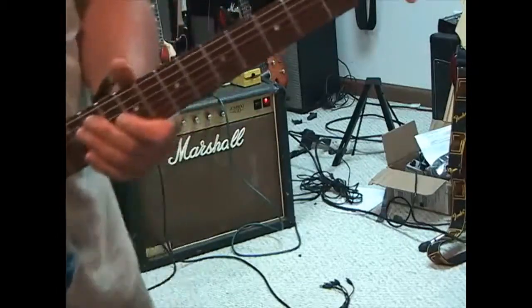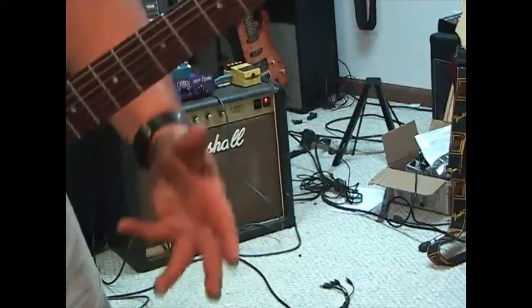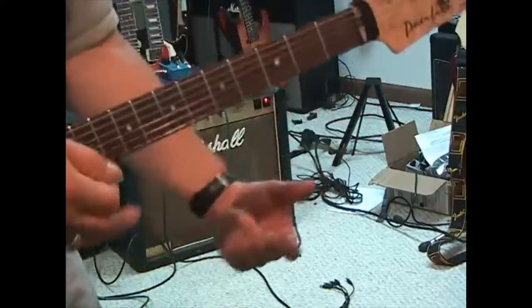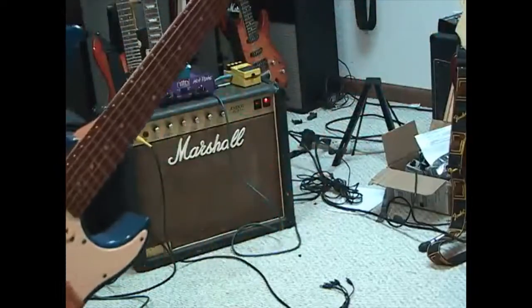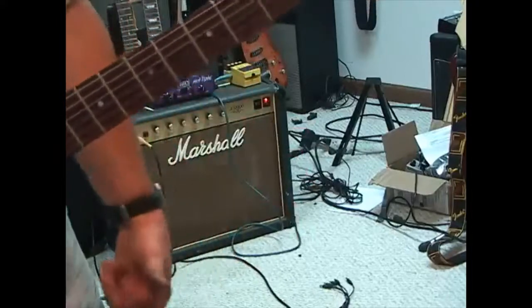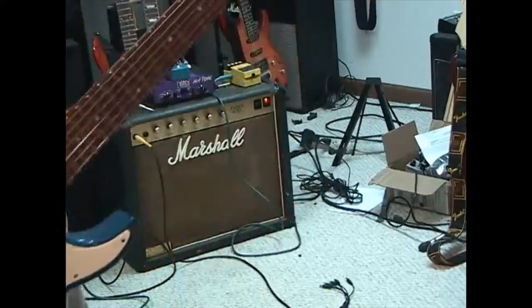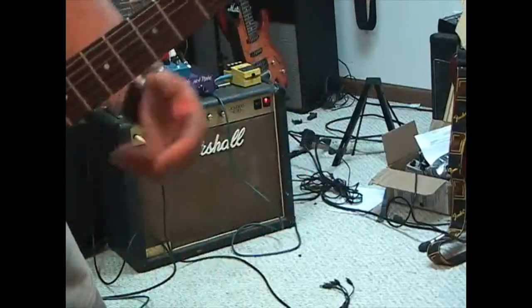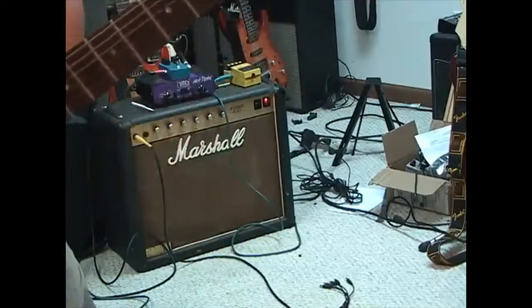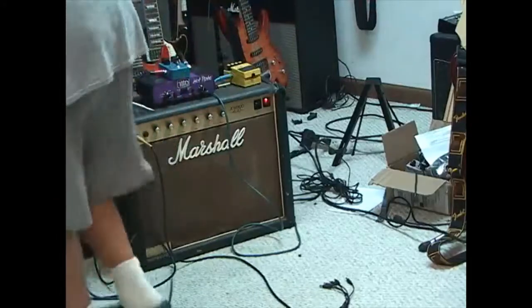One of the cool things they do, like what Eddie did, since these amps do not have an effects loop, is run out of the back. I've got a hot plate, which you can take the signal from the main speaker out, either run a dummy load or split it, so you can run into a delay unit and then out into another powered cab or something. I've got a really crummy little old power cabinet over here.